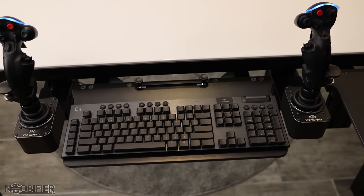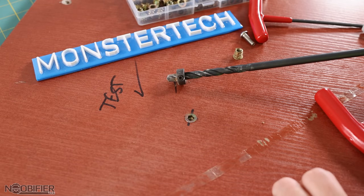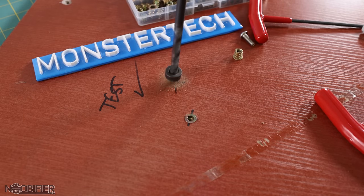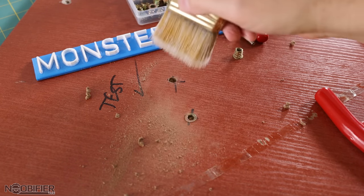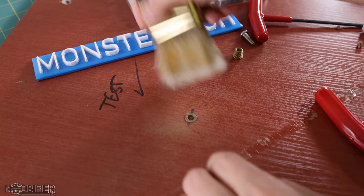Mine is suitable as it's a very dense MDF with an epoxy coating. Wood and MDF have a much higher density and are very well suited for the rail. Particle board and less expensive melamine is formed by mixing wood chips and some kind of glue into a paste and then compressing a heated paste to form a board — quite similar to MDF — but the result has more voids, resulting in a lighter weight board with less structural integrity.